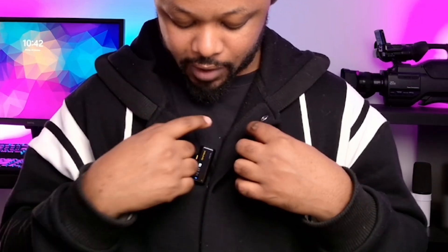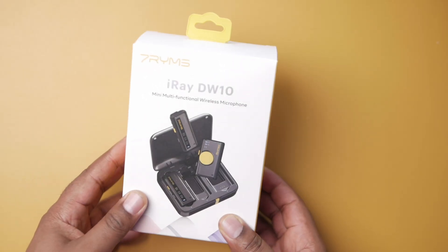The ideal positioning is about four to seven inches from your mouth — the perfect spot depending on what you're wearing. Some people don't like the microphone showing in the frame, but with most budget microphones you have to wear it on your shirt and make sure the capsule is pointing directly toward your mouth. Also avoid clothing rubbing against the top of the microphone as it creates weird sounds. Do a quick recording and test with your loudest voice to find the perfect spot.